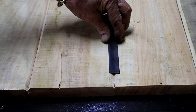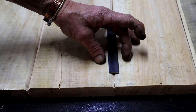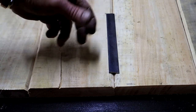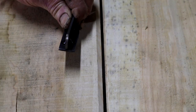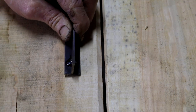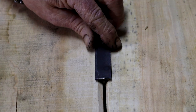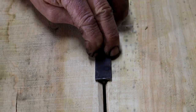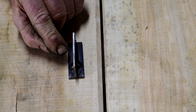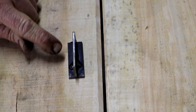But so how do I keep this in place though? I suppose if you use a wider flat bar, you could drill holes and then screw it from the top. But I don't want to do that. So I tacked together two pieces of this flat bar to form a T-section with the idea that it can go in like that. I think that'll work quite smart. And then I don't have to fasten it through the top. Now I can't buy a mild steel T-section in this area where I live. So I guess I'm just going to have to make this up then.